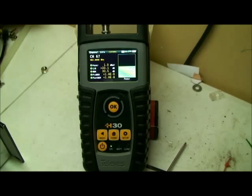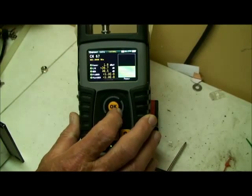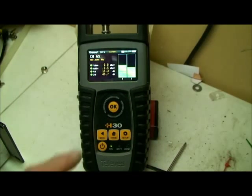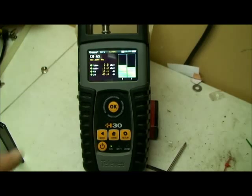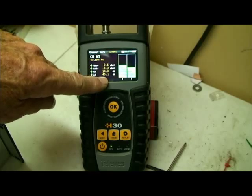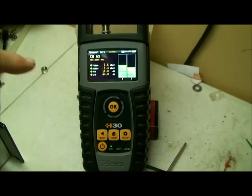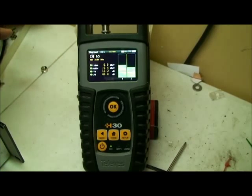Now I'm on a different channel here, channel 67. Once I get to about 65, I believe it is, there are my analog signals. See, my analog signals are about 8 dB or so higher than my digital signals. So I've got 8 dBmV, and a carrier to noise of about 45, which is acceptable. 40 to 45 is about minimum. You want to be at least better than that for analog. So my analog spectrum starts at about channel 2 and goes up to channel 65.